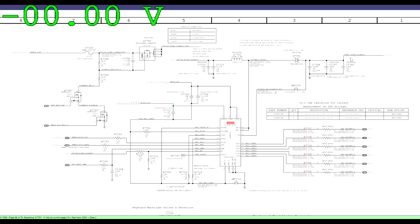So if output is 0 volts, either the fuse is blown or the transistor is not opening over here. That's supposed to be opening and letting backlight voltage through. And in really, really rare cases, a bad coil. Actually, not even that. With a bad coil, you get 0.6 volts. A bad coil, because it's cracked or broken internally, would mean 0.6 volts in backlight output.